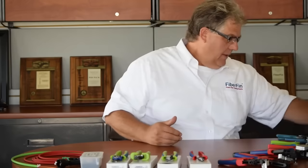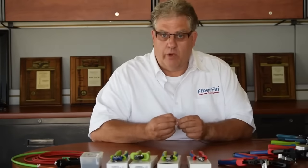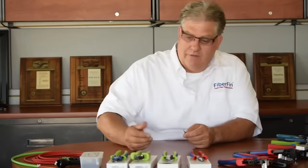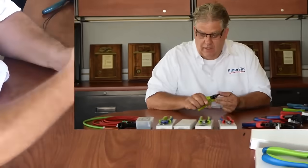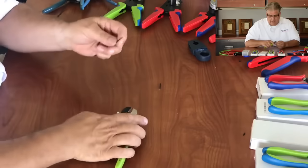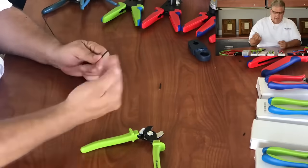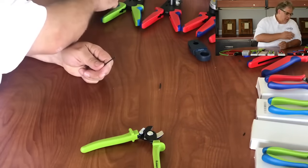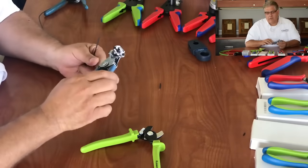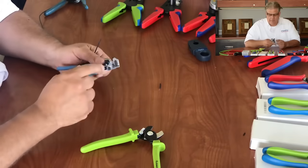The first thing — this is your standard one millimeter diameter core, 2.2 millimeter jacket. So usually you're going to have something like this universal two cutter in your toolbox, which will cut it to a specific length if you're running it off a spool. Now you have to strip it, and that's what this video is about. Our favorite tool, and the one that the girls in production like best, is this Ideal stripper.